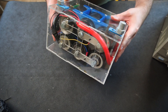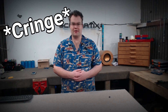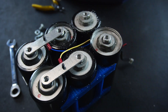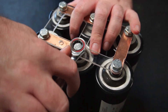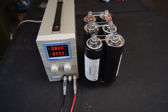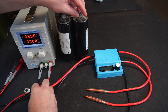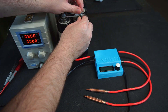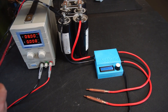Old time subscribers might remember this - it's a super capacitor bank I built to replace a lead acid battery, built many moons ago back when my fashion sense was questionable at best. I opted to replace the alloy bus bars with copper ones which will reduce the overall series resistance of my capacitor bank and hopefully get me closer to the magical 1500 amp threshold. The only way to limit current is through voltage control, so I set my power supply to 8 volts and charged up the caps. Later I can increase the voltage until I hit the 1500 amp sweet spot if needed. The cables are directly bolted to the super caps, which kind of scares me because if I do something wrong and need to switch off the power quickly, well it just isn't going to happen. However, throwing caution to the wind and having my mother on speed dial, I proceeded anyway by connecting my power supply to the caps to continually top them up as I weld.